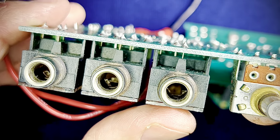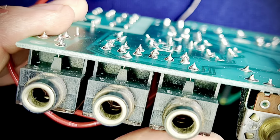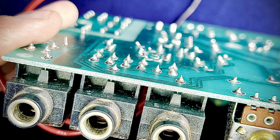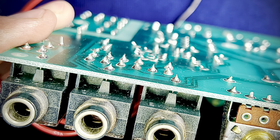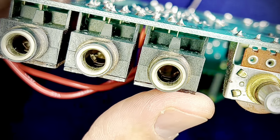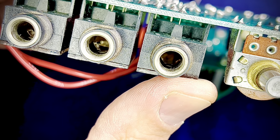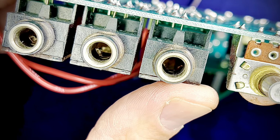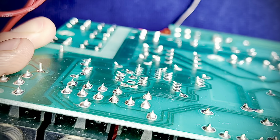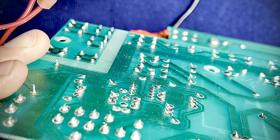And then what we also have is a poorly seated jack. And what happens is the geometry between the barrel of the jack and the actual chassis punch and then, vis-a-vis the faceplate, is off by a degree or so. You tighten the thing down and it's going to torque it over. It has no support. Might as well not even have legs. It's literally just being supported by the leads that are passing through. So we're going to fix that.